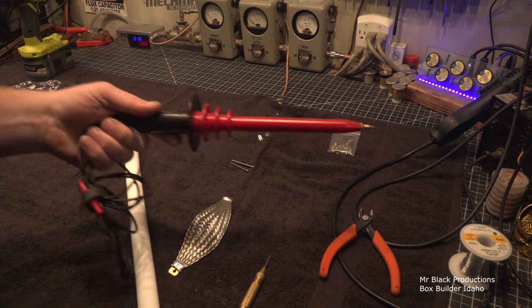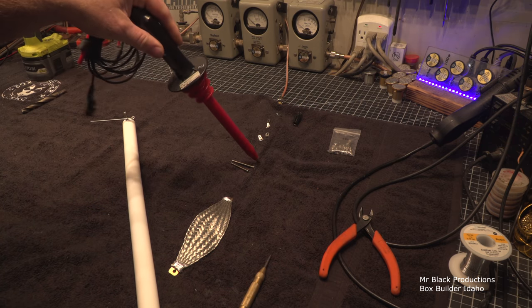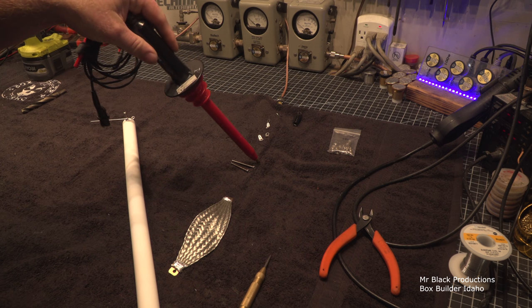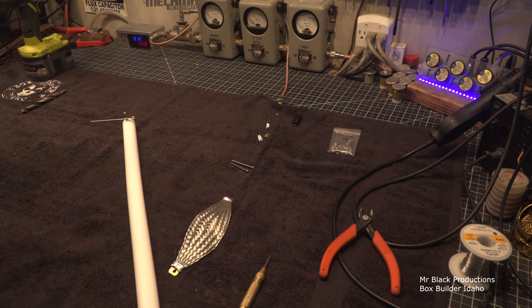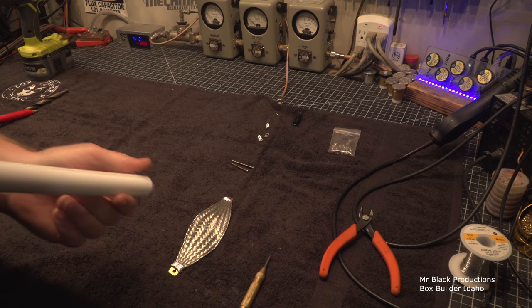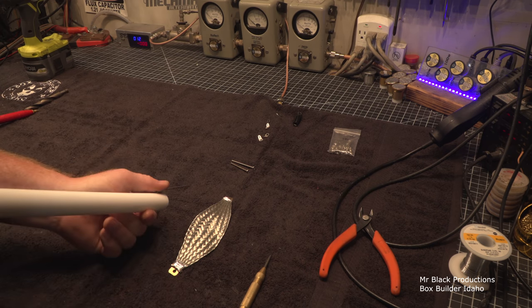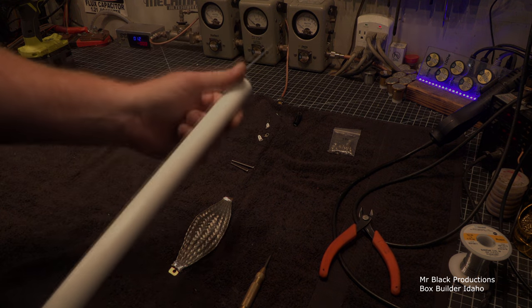I've taken my reduction probe with my increased surface area, inserted it into the project, and said, okay, we're at 200 volts and it's not going any lower. Something in the bleeders has failed. I want to be able to take this and go hook to the cabinet, go dap, and then hold it there and make sure that the capacitors are fully discharged. That's what this is for.